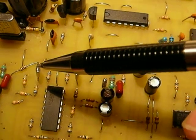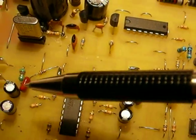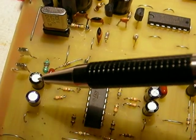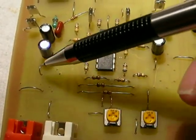Your coil is up here above the 100k, above the 1 microfarad. 0.01 capacitor on one side, 0.0047 on this side, 0.0047 on this side, then a 1k to here, 0.01 cap here, 0.01 cap here, 68k here, 68k here, 68k here, 0.01 here, 100k here, 39k here, 47k here, 47k up here. 1k from this hole up here down to this hole joining this 0.0047. Your coil is right here — 2.2 — and then 0.01 here, 0.01 here, and your 1 microfarad, 1 microfarad. Make sure you didn't forget any of your jumpers — you have a jumper here.